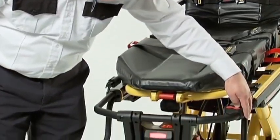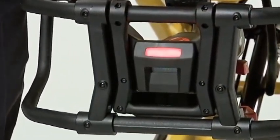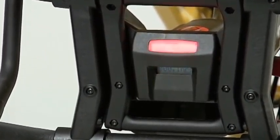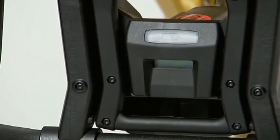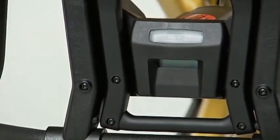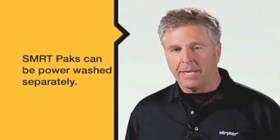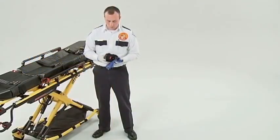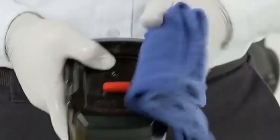The SmartPak has no memory and performance is not reduced by repeated partial discharges. Nevertheless, best practice is to keep using a SmartPak until the amber light on the PowerPro XT indicates it's time for a freshly charged SmartPak. Do not try to use a SmartPak for service calls after you have seen the amber indicator, or you may shorten the SmartPak's life. Remove the SmartPak prior to power washing the PowerPro XT. In the event the SmartPak is exposed to contaminated fluids, it can be power washed separately if necessary. Never submerge a SmartPak; be sure to dry it thoroughly prior to insertion onto a PowerPro cot or a charger.